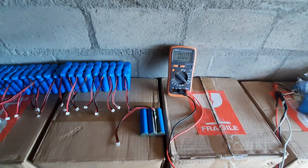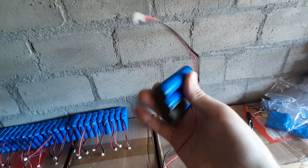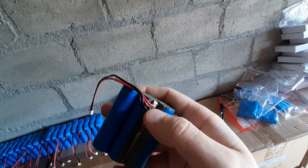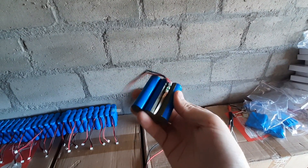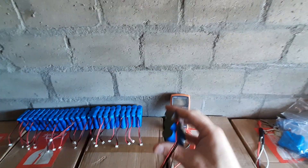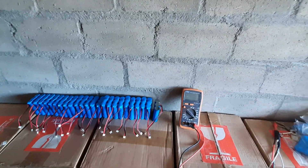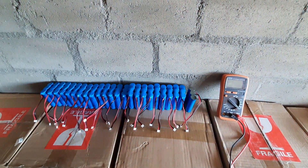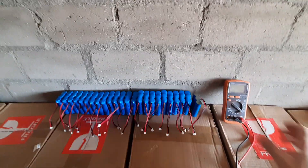This one has been stripped of its heat shrink, which gives it a very nice flat top and bottom surface. You have the negative plate at the bottom, a negative bus bar coming off there to a little board, and a positive one coming from the top of the cells. This flat surface will be very convenient for making series connections when stacking the four packs on top of each other. Between the bus bars of each group of 23, we'll just connect one thinner copper bus bar to keep the whole single 1S pack at the same voltage level.